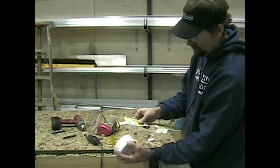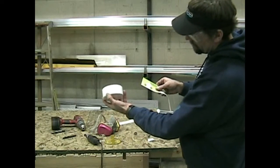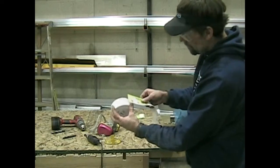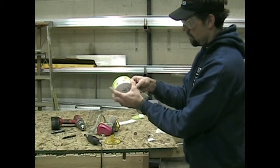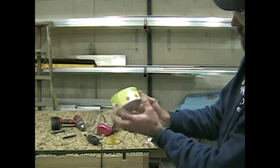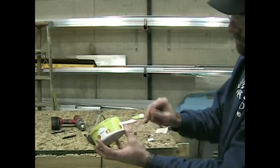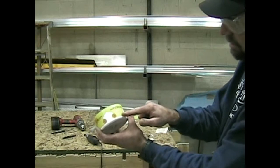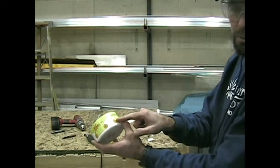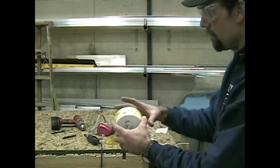We're going to try to put the edge of this sticker right along the bottom of this PVC cap. As we look around, it should come out as close as we can. We'll just float that difference, but we've got all these different orange circles with these X's in here. These X's indicate where we're going to pilot our 1/8 inch holes.